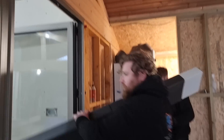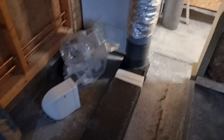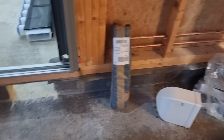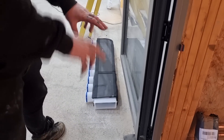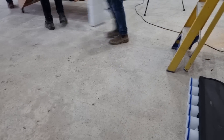The guys are busy doing all the technical work. This is our supply air coming out the top of the unit — we've obviously had to go down to 220 by 90 to get through to the manifold, and that goes all the way straight through there. It looks perfect.